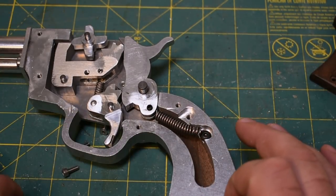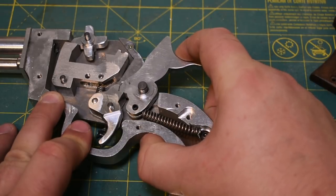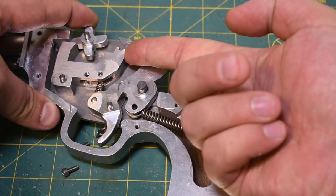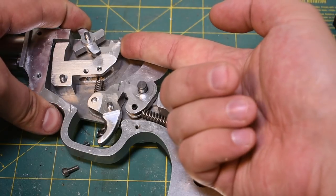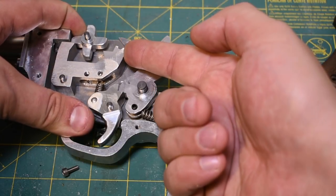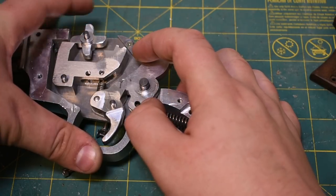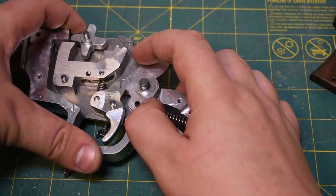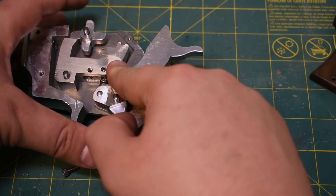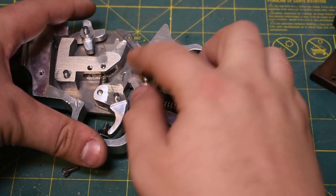Basically, if you've ever looked at how a clock works, you'll recognize this mechanism here is basically just an escapement and an escapement wheel. What happens is when you cock the hammer, there's going to be forward tension on this escapement wheel from the elastic band that's in it. When you release the hammer, it's actually going to hit this escapement here. The escapement is going to disengage, let this roll forward by an eighth of a rotation. Then this spring is going to return it, which is going to let it index one position. You're basically just taking a force that wants to release all of its power at once and forcing it to index through step by step. That happens in clocks — that's how they meter out the lowering mass. You'll have a mass that lowers and the pendulum will be connected, clicking back and forth, making the clock only move in discrete steps. In this case the escapement wheel makes sure that only one shot fires.